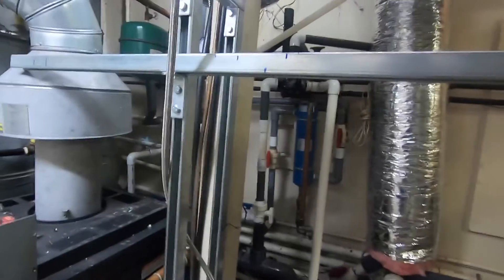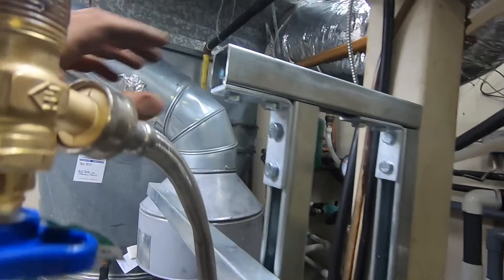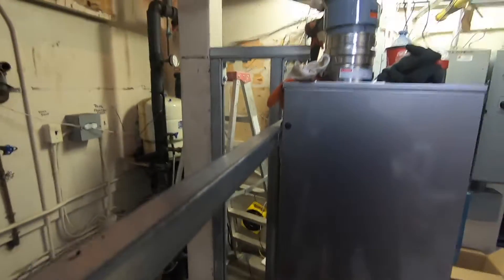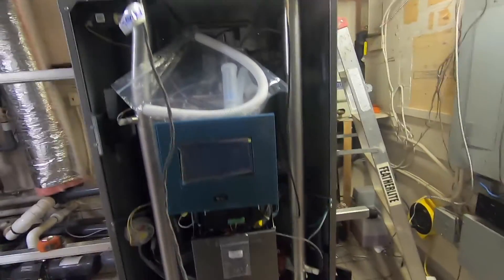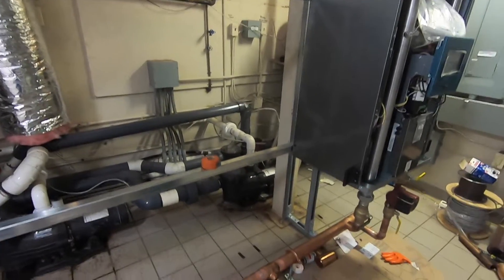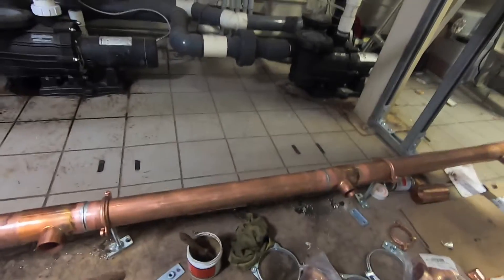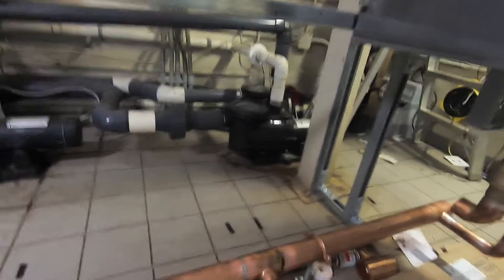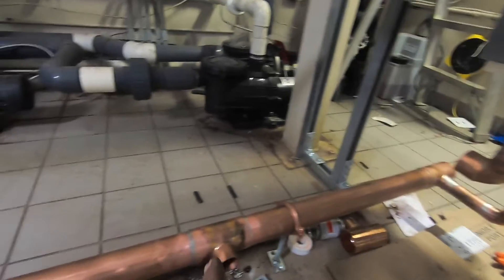I'll show you how I did the framing for my boilers — all Unistrut. I tied them in with the existing supports here. I'm going to be putting another support in the middle. One boiler is mounted. I would have all boilers here but the order got screwed up — sucks. But we can still continue the piping, which I'm doing right now. Two and a half inch main trunk. Did a few measurements. I'm going to have four boilers here — if your measurements are pretty close you'll get it dead on. This is my return side loop and my supply is going to be right on top. Got threaded rod here — just temporary, I'll put them in place after. Pipe stays.